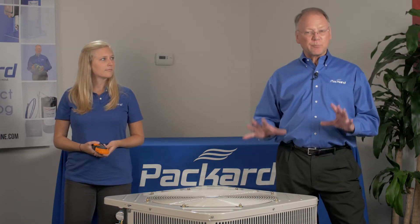Static pressure is the pressure on the system when the air is not flowing — when it's static. It's typically measured in inches of water column. As we add static pressure to this, it will affect the performance of the fan, and that's what we want to check today.